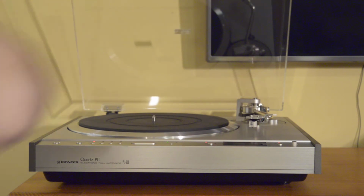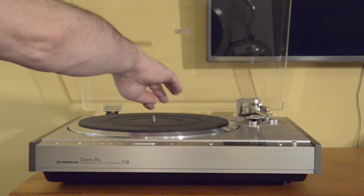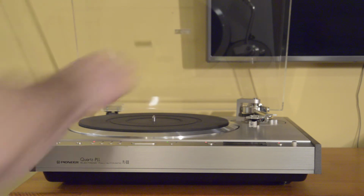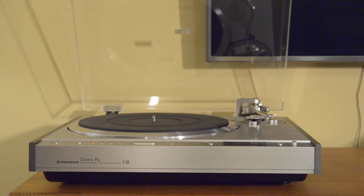removing a little cover here, and you know that can sometimes get a little sticky and give people problems. So I remove that again, clean it and do the same thing there. So that really gives you excellent performance from the standpoint of the tone arm. It's a little motor in there. Now, it's not unique among the high-end direct drive turntables that all the automatic functions have their own motor and are completely disengaged from what's going on with the platter. That's actually fairly typical at this level.